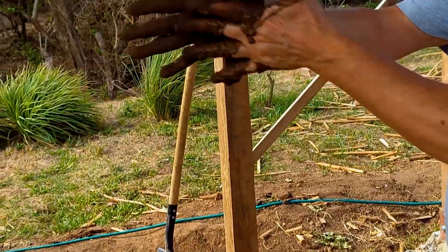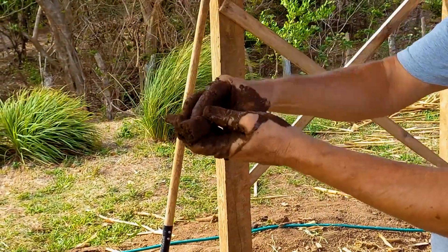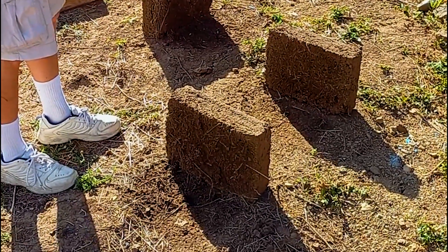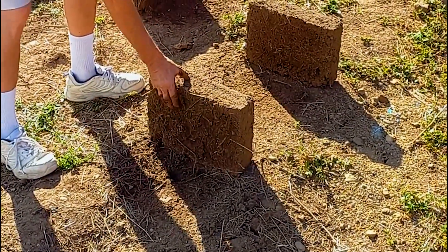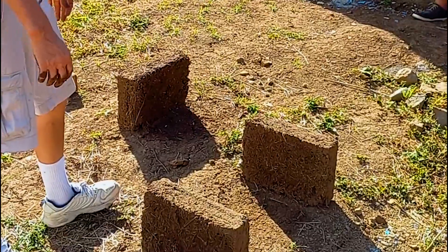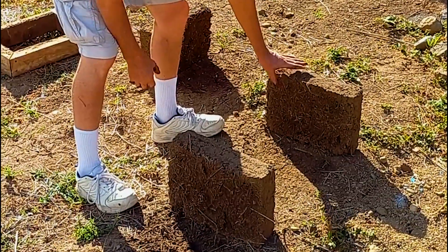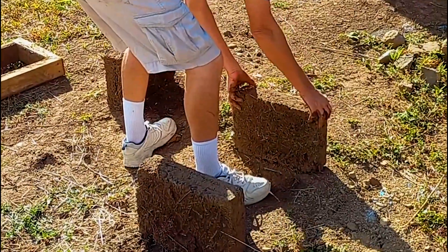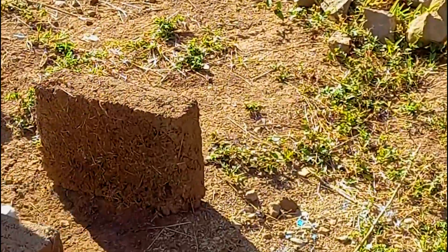The longer you can make the snake, the more clay you have. This is not pure clay, but almost — it's going to be just clay and sand. The final test is actually to stand on it and see how strong it is. And this one is also sand and clay with straw, so that's much stronger. That's basically the mixture that we're going to use, and that will not break easily.